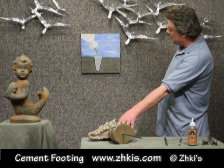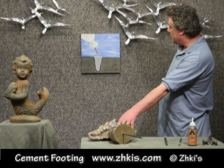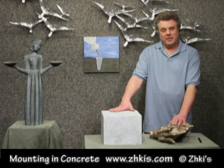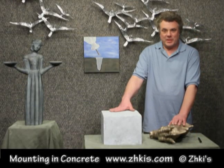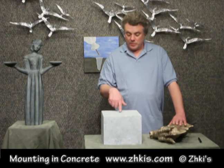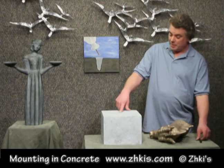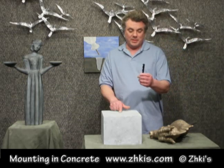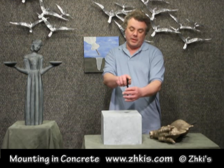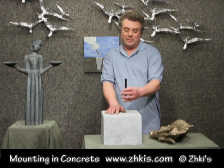At a later date, if you have to move it, you can dig it out and move the whole footing and all, then just replant it somewhere else if you like. Another way that a lot of people don't think about is mounting their statuary to a concrete slab. This is very easily done by drilling a hole right into the concrete — the same size as the rebar you're going to use. It requires a special masonry bit, which is a little different than a wood bit — it has a point on it. We'll show a close-up of this later for those who don't know what a masonry bit looks like.